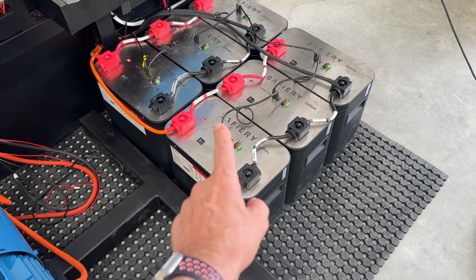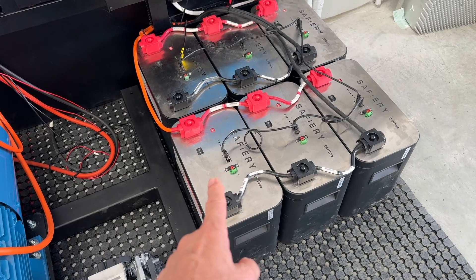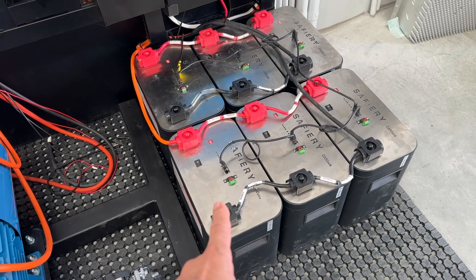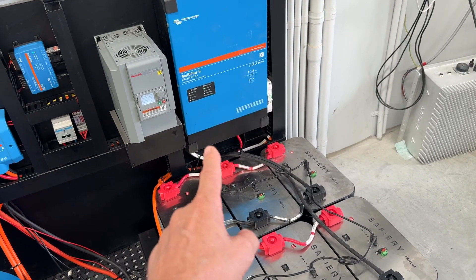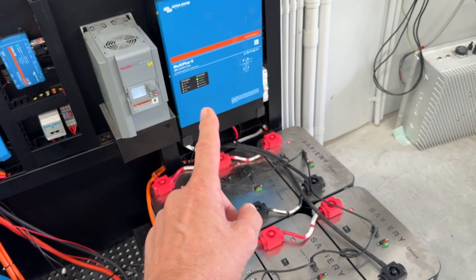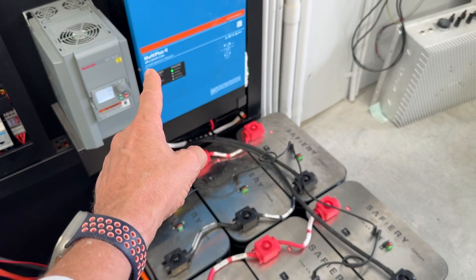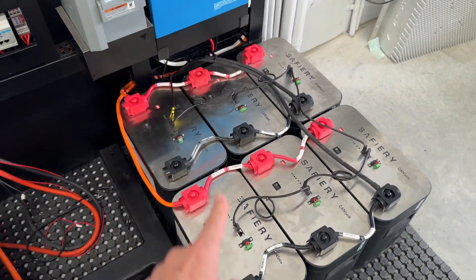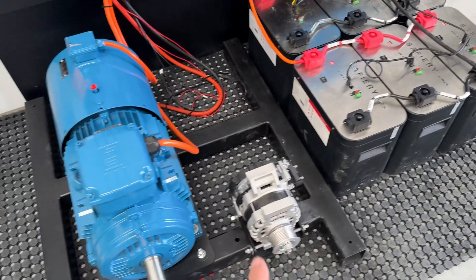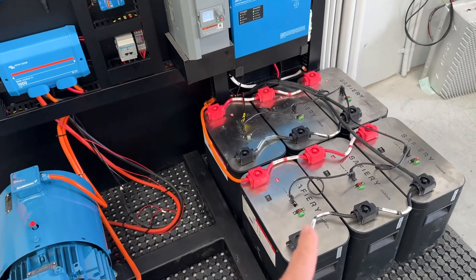The problem I had is those batteries there will take about 9, maybe 10kW. They can take more than that for a limited period of time. But I put the 5,000W inverter on here running the shop lights and shop loads. So if I turn it on, it'll put an additional load on the circuit of about 4.5kW. So I can have 4.5 plus the 9 here — 13.5kW. We could be lucky. So that's a stopgap in case I don't have enough load.